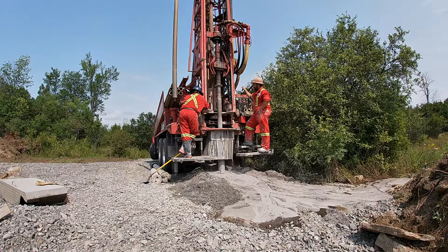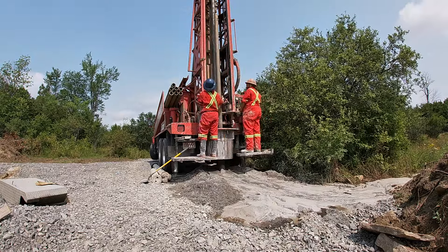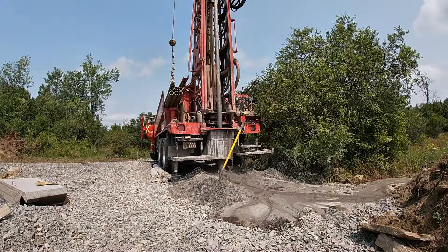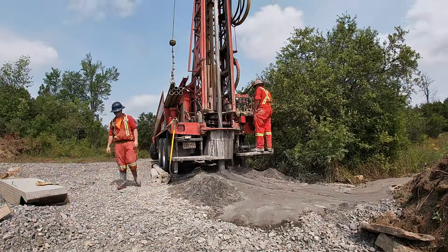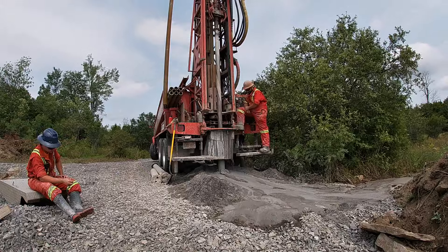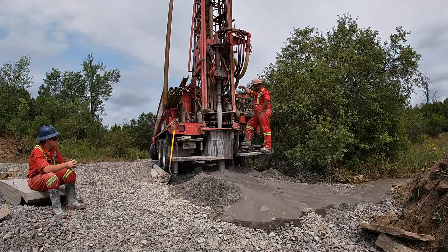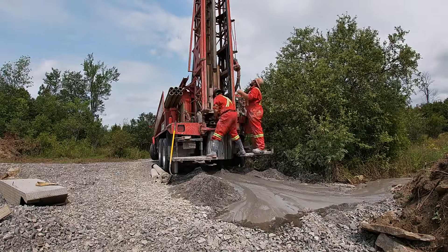Here's some time-lapse footage to give you an idea about the process of loading in these additional 20-foot lengths of pipe and or drill bits — I'm not sure which is which, but that's happening at the same time. You can see how the machine itself drills down once you've got that additional 20-foot length in there to keep the process moving. Given that this is time-lapse, you can see how this will take four to five hours to get down 200 feet in bedrock. This is rock all the way down — no sand, no clay, no soft materials. All bedrock all the way down.